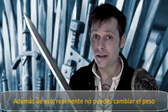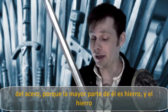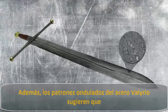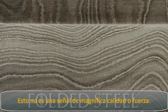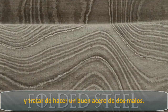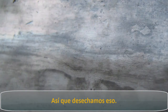On top of that, you can't really change the weight of steel — it's mostly iron, and iron's heavy. Valyrian steel is supposed to be quite light. Also, the ripple patterns of Valyrian steel suggest that it's been pattern-welded, or folded. This isn't a sign of superb quality and strength; it's actually a way of compensating for poor materials and trying to make a good steel out of two bad ones. Also, if the folding is done correctly, you don't have visible ripples. So that's kinda out.